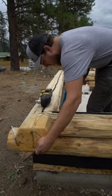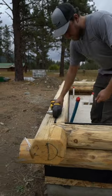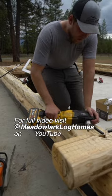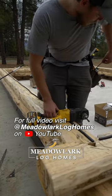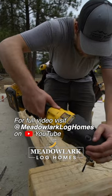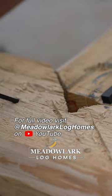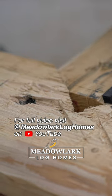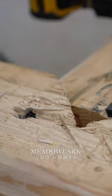Get them as tight as you can before starting to screw. If this log wants to pick up too high, you can loosen the screw a little bit, and then we'll put one in from the other direction, and it'll kind of help keep it down. We'll tighten this one up, and there we go, nice and flush on top there.